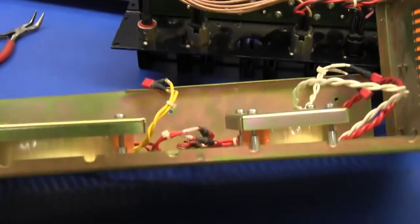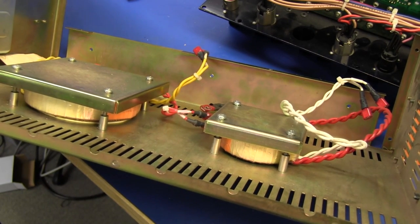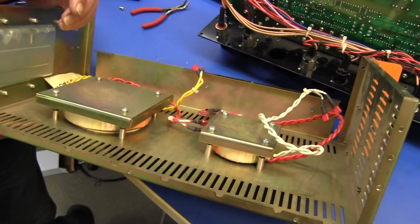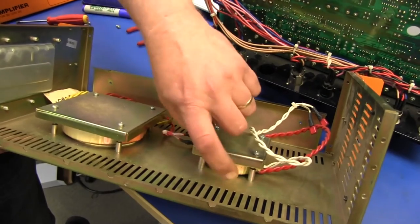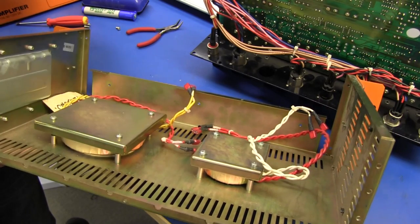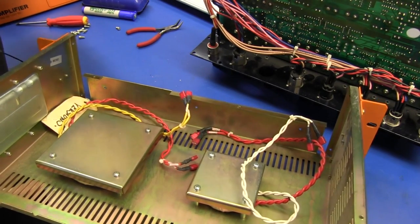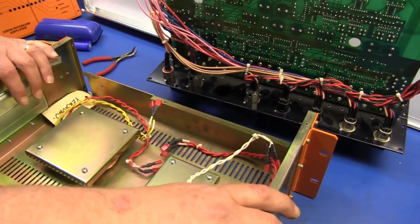Okay. We're in. What we've got down there is the two toroidal output transformers. The power amplifiers, since they run from a nominal 120 volt DC supply rail, we designed them simply to be a push-pull class AB amplifier run directly from 120 volts, which gives us an RMS output voltage before clip of about 35 volts. So these transformers are 35 volt to 100 volt step-up transformers in 30 odd watt size and 150 watt size. And that's the one that the smoke comes out of in large quantities when you put 120 volt DC into the 100 volt AC side. Oops. Lots and lots of very, very solid 1.2 millimeter punched steel, all good solid stuff.